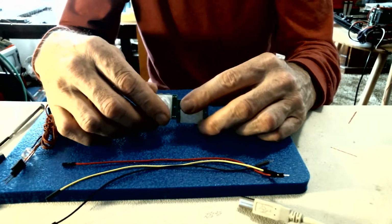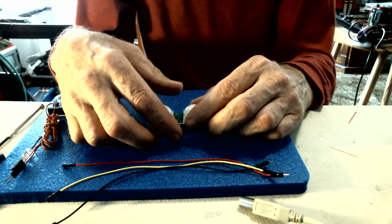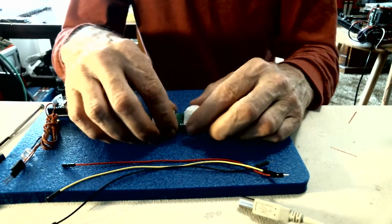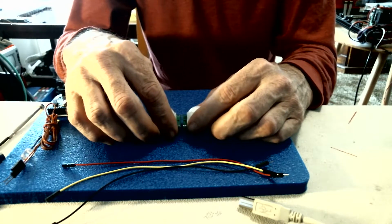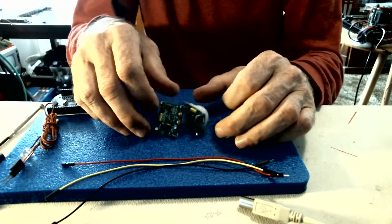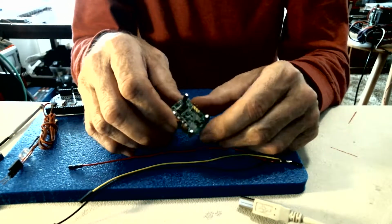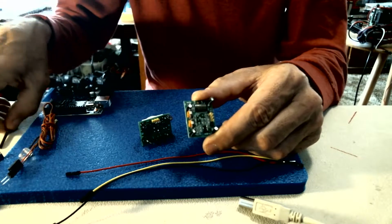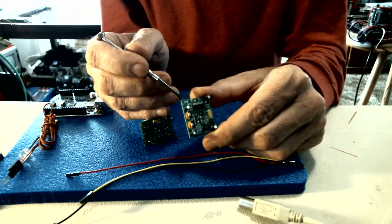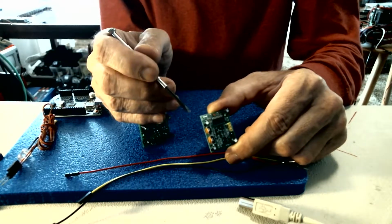So now that we got the pros, well, we didn't get the cons out of the way. There's one thing I didn't like about this. Now they mentioned it in their ad that you need to solder either jumper pins or a switch on the trigger retrigger jumper, which is fine with me. I don't have any problem with that. However, the only thing that I ran into was those solder pads are so small. For the beginner, you just wouldn't be able to solder them hardly.